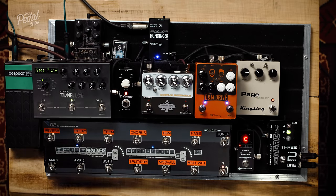So he's just got his valve amp and all the lovely goodness, and then the Axe FX is being hit by the same signal that's hitting his valve amplifier, but then adds this massive processed stereo delay. But again, because he's hitting that lovely, toneful, glorious valve amp in the center, he can get as wet as he likes in the outside too.